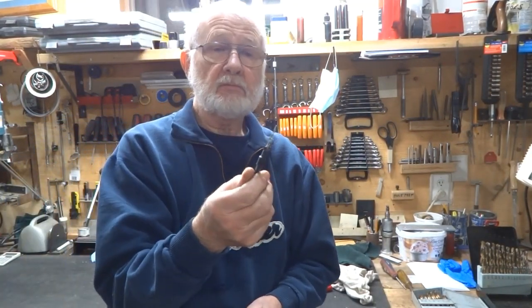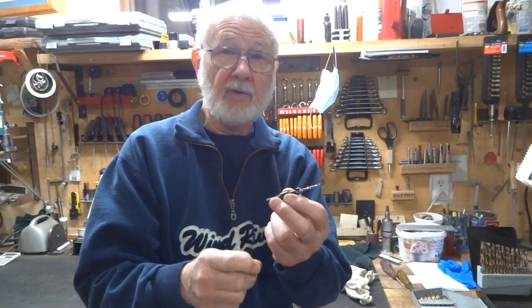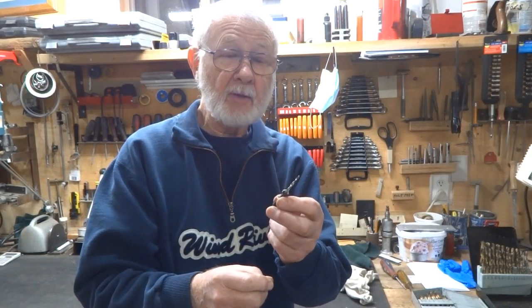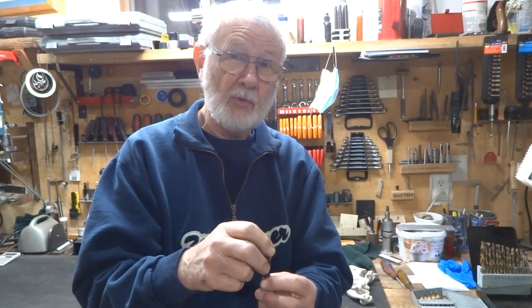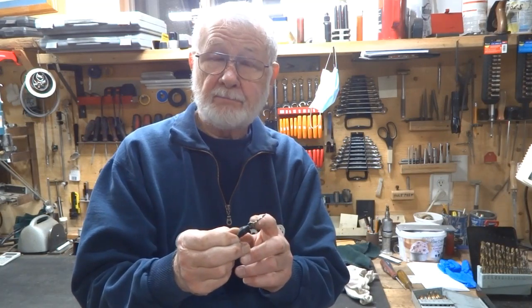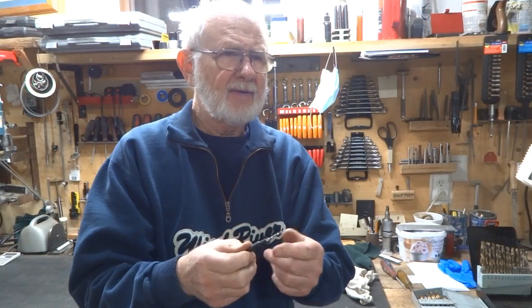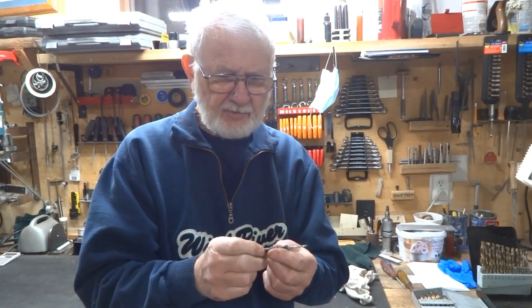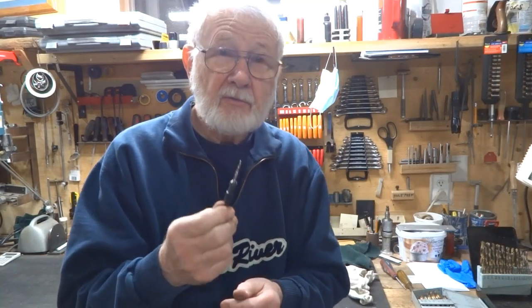This is a woodworking tool. If you were perhaps building a deck, you probably want to buy one of these to put in your electric drill, because not only does it drill the hole for the board, but it also countersinks it for your screw head, which is really nice and handy for woodworking. But I have never seen one of these for metal — there might be some, I just haven't seen one — so I'm going to try to make one for metal.